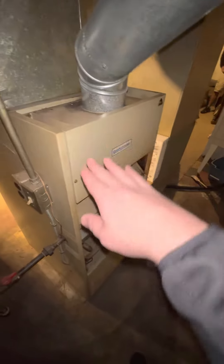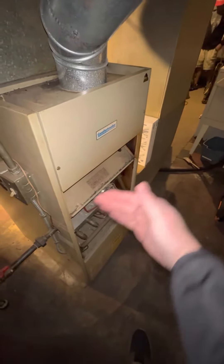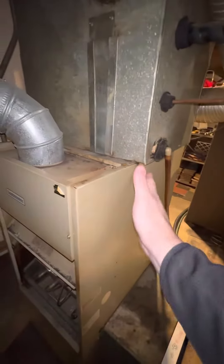It's kind of an odd size — about 48 inches tall, just underneath the A-coil, and about 19 and a half inches wide. The new unit coming in, I'm probably going to try to order an A-coil, because this coil turns sideways here and is exactly 21 inches wide, so that'll be a nice smooth transition.